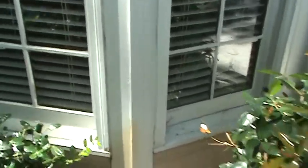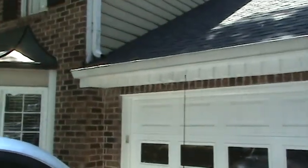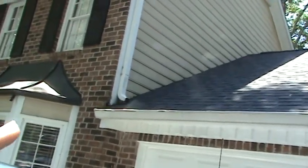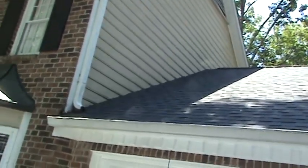On the right panel it's just starting to rot — see the black line there? The reason it rotted out, I can put my whole hand through it. It's gone on for a number of years, and most builders and contractors will never back prime those materials, but we always do. When we get up on the roof side, we run into this all the time — contractors will install new siding and butt the siding right on the roof line, and you can't do that per code anyway. The siding should be about an inch and a half to two inches cut back across the roof line. Most of it looks to be in good shape, but the boys may find as we're doing this work that some of those boards need to be replaced, and we'll deal with it at that time.